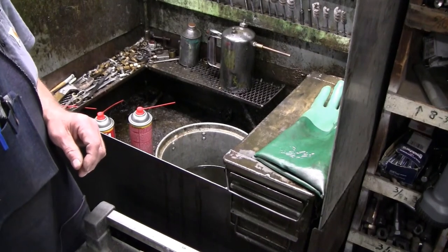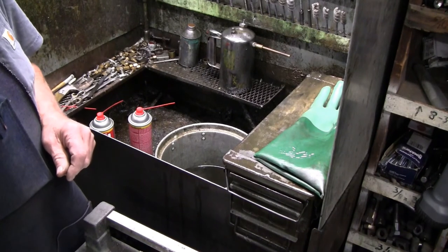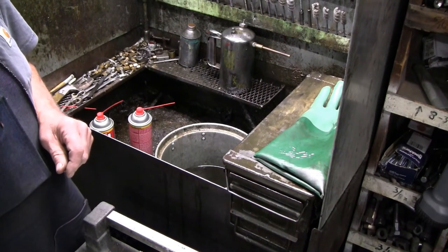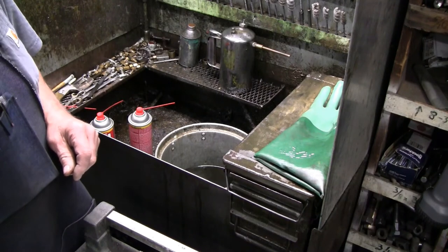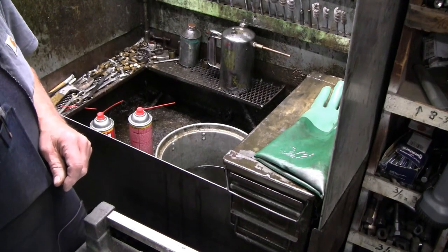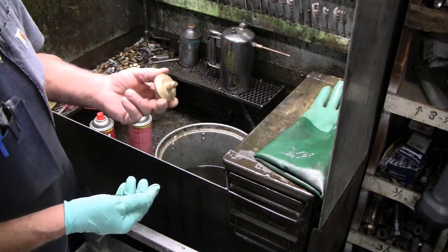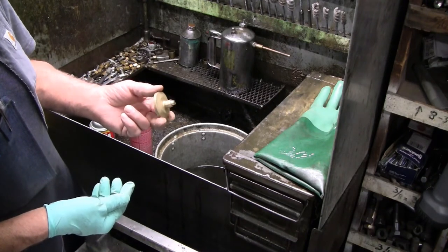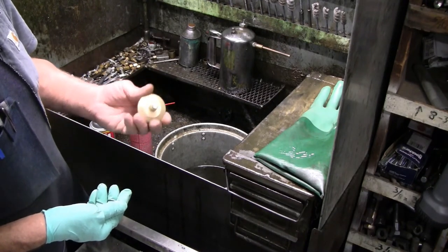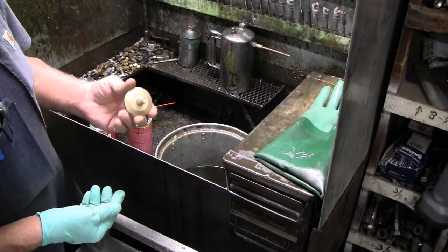This adhesive develops maximum strength in 24 hours. It's pretty good after just a few minutes. I would not even begin to be able to remove these by hand by trying to twist and pull on that, even with pliers. Within an hour, it might be 90%, and in 24 hours, it'll have the remainder of its strength. And it is